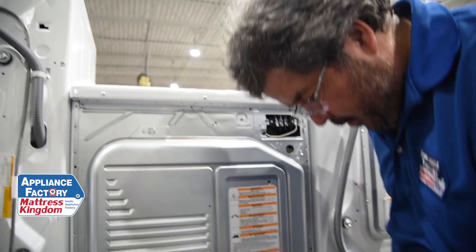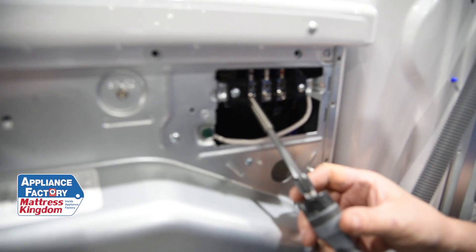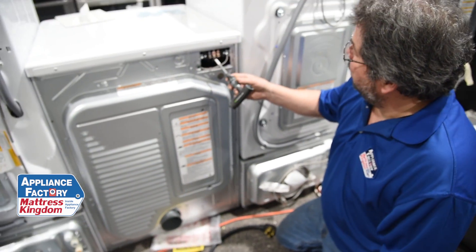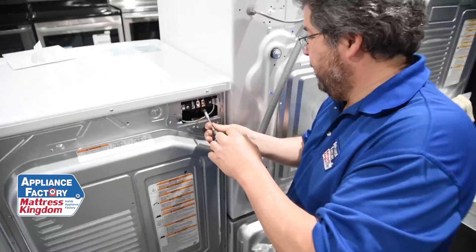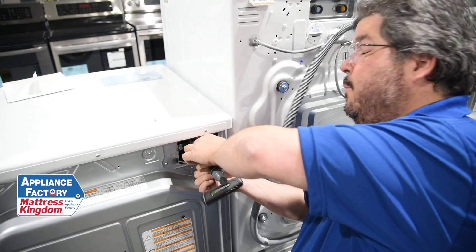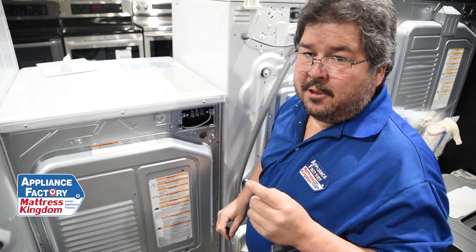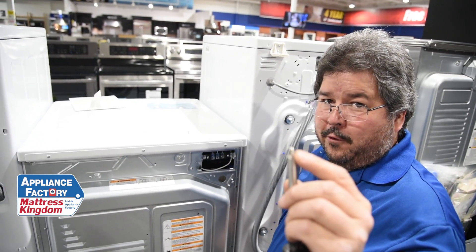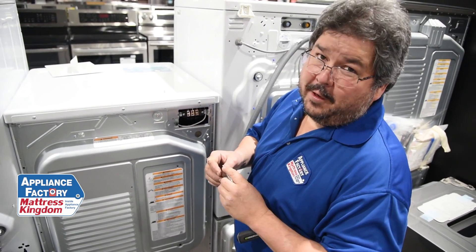Connecting it is actually pretty easy. The terminals take a quarter-inch head bit or a Phillips bit inside. I prefer a quarter-inch because I get more traction. Get the screw most of the way out and put your finger on it before pulling it free, because if it goes down in there, you have a problem. You can't just put any screw in there — it's a certain thread screw. A wrong thread may go in but you'll never get it out, and it may not make a good connection.